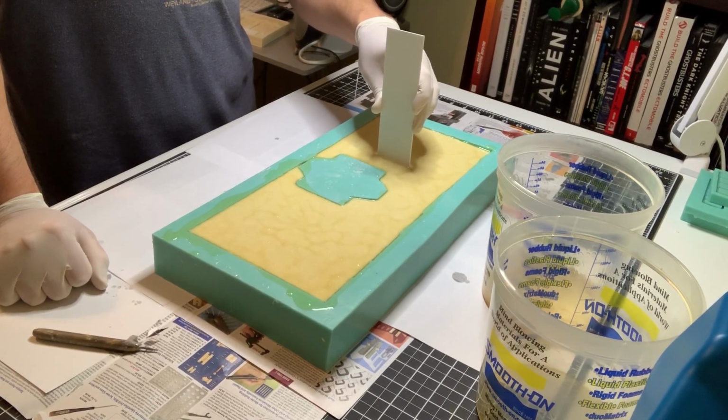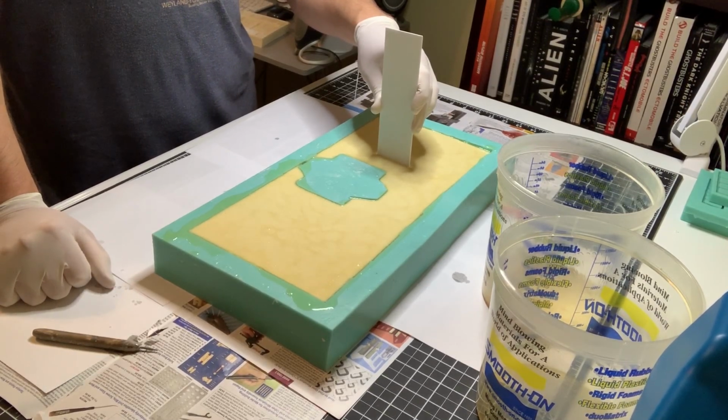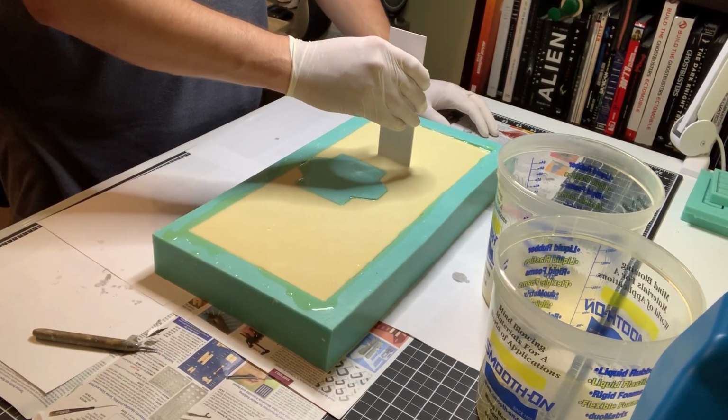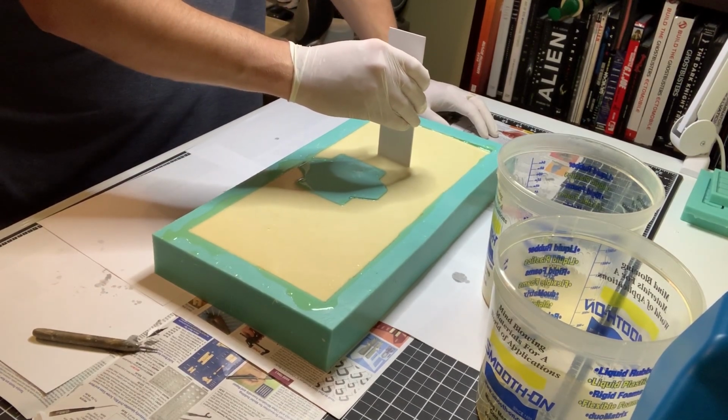basically what I do is I let up on it just a little bit to see whether or not the resin's taking effect or not. Resin's not taking effect, so I don't want to do that too much, because that resin is still very soft and very pliable. If I keep doing it, I might damage the look of the surface of the cast. I don't think it would work for everybody. It just happens to be a situation in which this little process of having to repair a warped mold works.